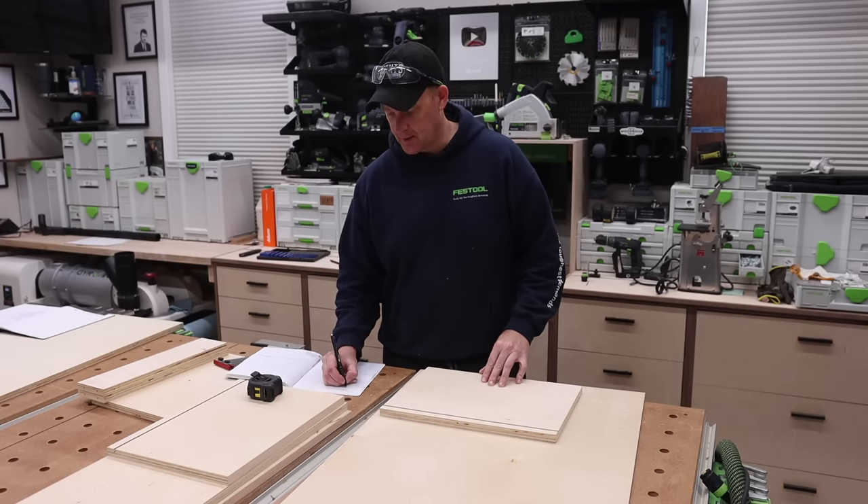Now let's get into the assembly. The method I'm going to show you is the most simple, basic method — assuming these cabinets are going to go side by side and the sides are not visible, like when redoing a kitchen or in an enclosed wall section. I start using a flat reference surface: my table. I have my line here, and the back of the cabinet lines up flush. I'm going to use a narrow crown stapler and put a couple of staples along this line to give it some holding power, which makes putting in the screws much easier. You can do the same thing with a brad nailer; I just prefer the narrow crown stapler.